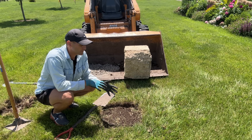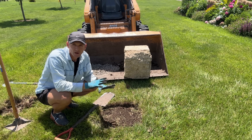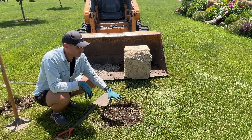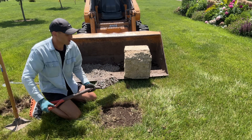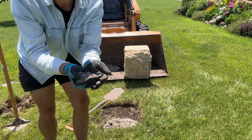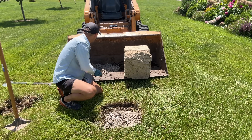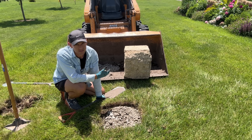When working with a patio professionally, you'd have multiple layers — crushed rock, sand, and then your final material. In this case, I'm not wanting a level walking surface. This rock is purely for aesthetics and to help the plinth not sink into the soil, because this is a lot of weight. I'm adding some crushed limestone — this is a larger three-quarter inch, not washed, which I prefer. See how it has all that fine sediment? That's going to help it pack in better. This is the same thing I've done at my house and it's not needed to go a foot down for something that's purely aesthetic.